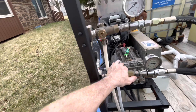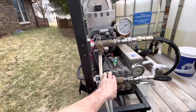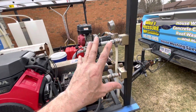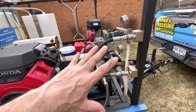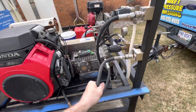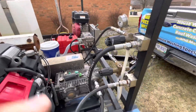Let's talk about the unloader tree. I like the 310s by General Pump. I do have the K7 unloaders, but I didn't really enjoy them. Someone was telling me that the K1s work better than the K7s, but I just like to use the pressure-loaded unloaders for everything and I'm going to stick with that. I chose to have everything in the same spot because I like simplicity and the clean look, and I don't want to have to climb over anything to change the pressure. I have these unloader blocks that you can get from Russ at Southside Equipment for a handful of dollars, and then everything runs off of a whip line. You can run a plug and a quick connect off of your pumps — that's what I have done there, as you can see.